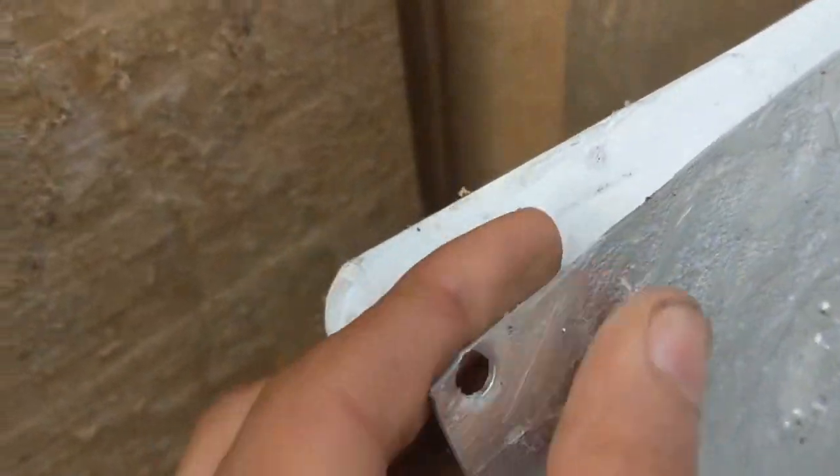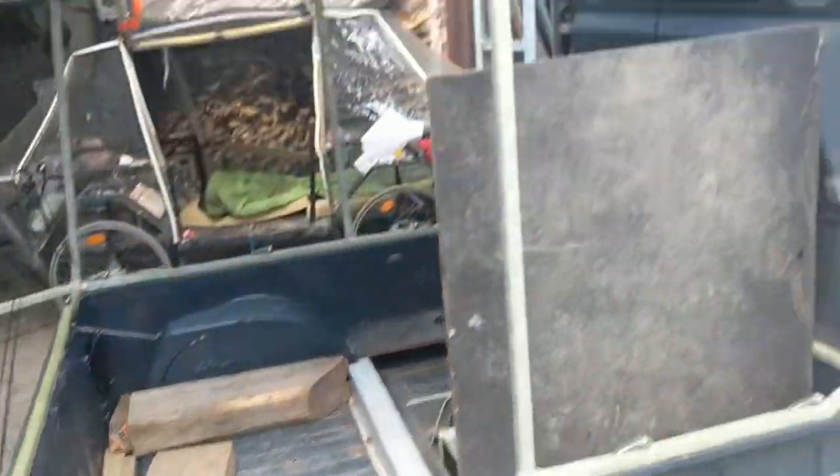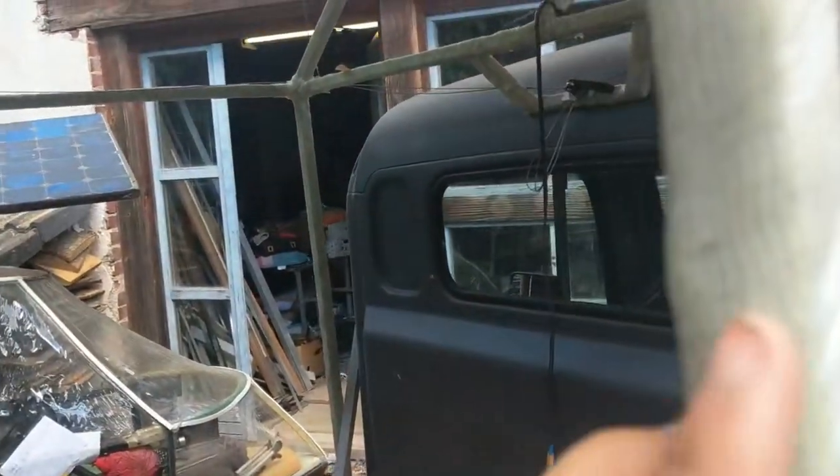By the way, there's a one millimeter aluminum foil inside — it's not flexible steel, it's aluminum foil. And then you have these two types of fiberglass. Outside that's the unidirectional. It's a problem if you make all four sides with unidirectional, because it's hard to make it go around over the entire structure. That's why you start with these square slices and spiral going down.